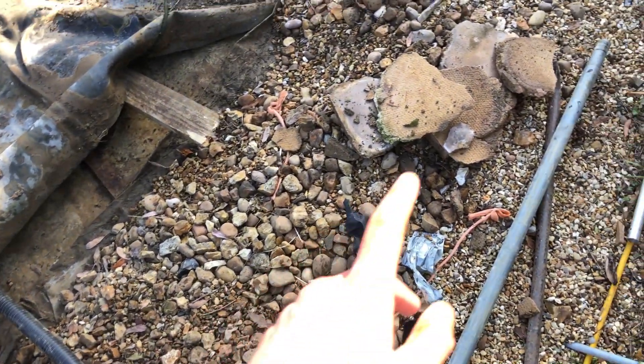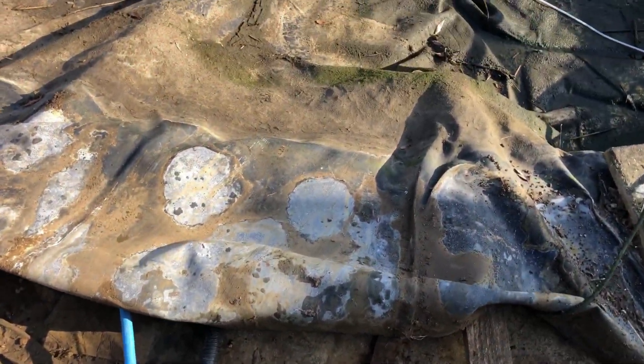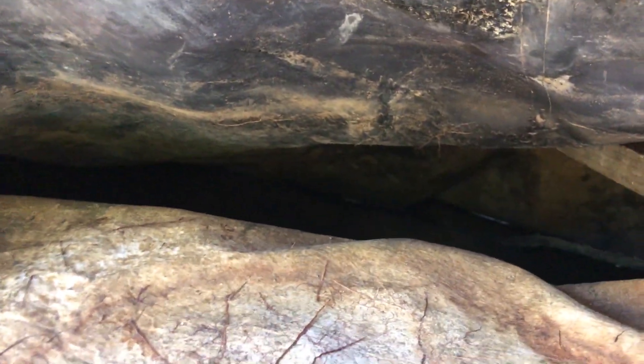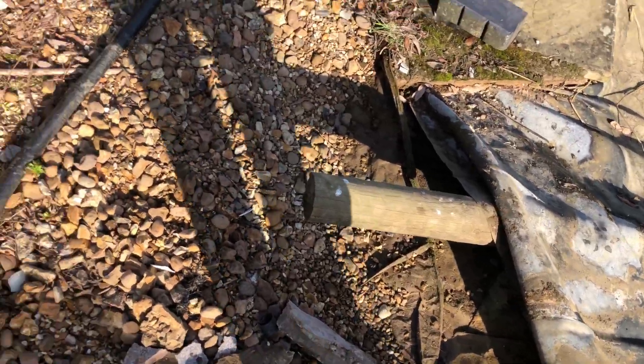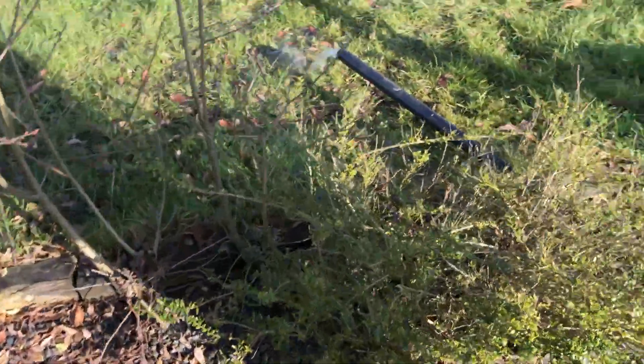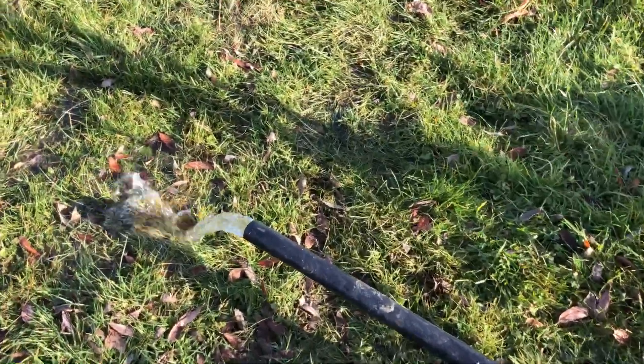Here's a close-up of what we were doing — we removed three slabs and pulled the liner up. Underneath the liner was the membrane. We had to shimmy the pump under the ledge to get it as deep as possible. You can see the water there. With a bit of flash you can see the membrane stays stuck to the ground, keeping the mud out, and the water is nice and clear, being pumped out through the pipe.